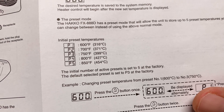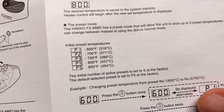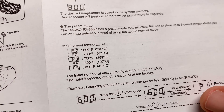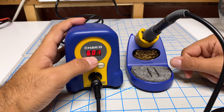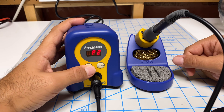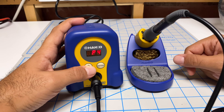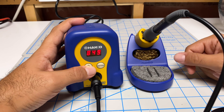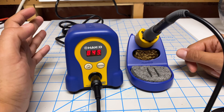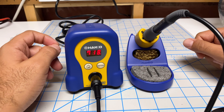The manual tells you what those preset temperatures are. By the way, the manual that comes with is more of a quick start guide — the full manual is on the Hakko website, linked in the description. Now that we're at 601, I can press the up button and that tells me 601 is preset one. I can go to preset two at 700, number three is 750, and preset four is 850. If I want to go to 850, I press the enter button and now it's going up to 850 — an easier way to navigate between temperatures.